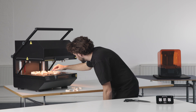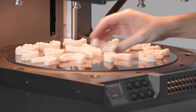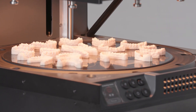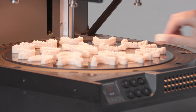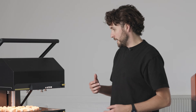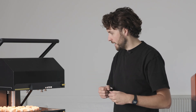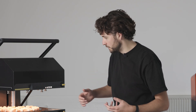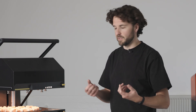A few more models here. I'm also just keeping one eye on where the sheet is. Our auto leveling system is keeping that sheet perfectly level. Obviously, we've got a little bit of a temperature differential between the centre of the sheet and the outside — it's about 10 to 20 percent, depending on the types of materials that you're using. But we've not seen a huge amount of difference in the changes in the materials that you're actually using.